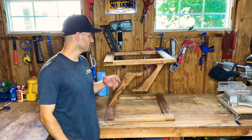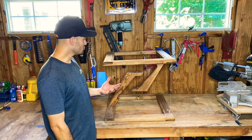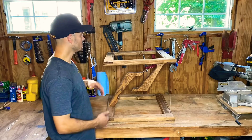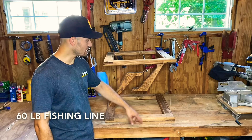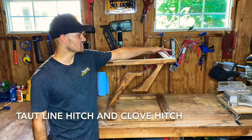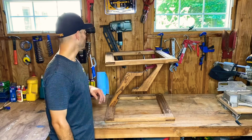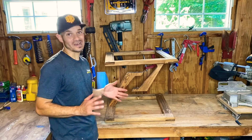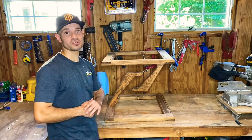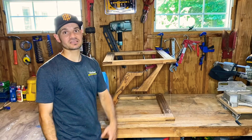I'm finally done — this was quite the undertaking. This tensegrity table took me a couple of days figuring out the geometry, physics, and what kinds of knots to tie. The top structure and bottom structure are the exact same — a 2x4 that I ripped, molded, and shaped into this design. I used 60-pound fishing line with four corner lines plus one in the middle — a taut line hitch at the bottom and a clove hitch at the top to get it really taut. It floats — pretty cool! I'm going to have a glass top made; it should hold maybe 15 to 20 pounds. If you're into any other DIY projects, home renovation, or gardening, please subscribe — I've got more cool tables coming in the next few weeks. Thanks for watching!